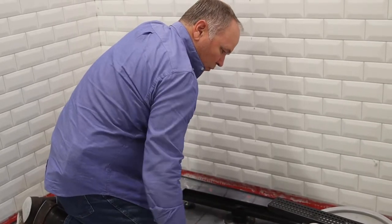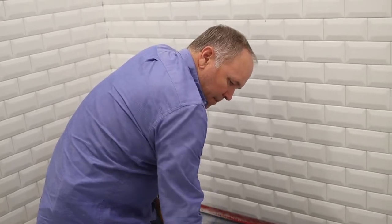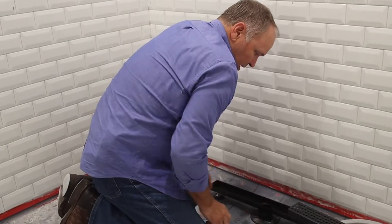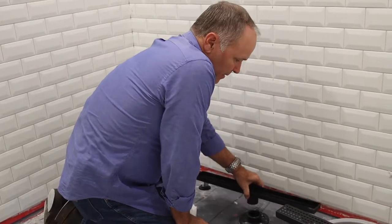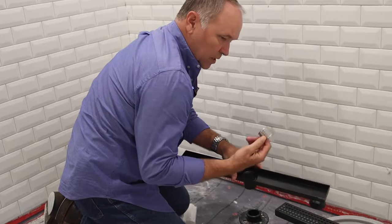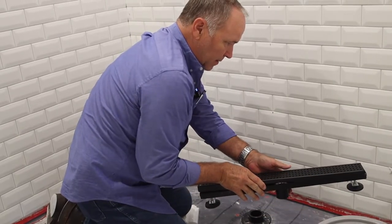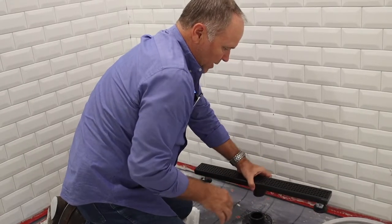The majority of the water comes in on top because you're putting a mud bed in here that gets to the right height. Then you put in the strainer, which is easily removable so you can take hair out of it, and then you put in your top grate — that's the finished look you see right here.